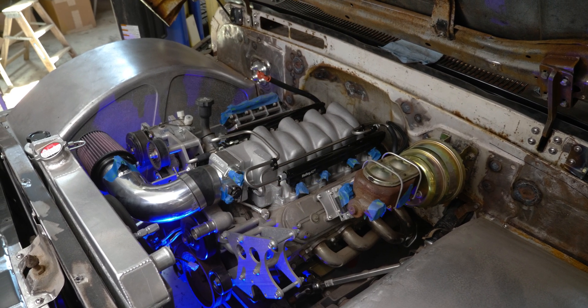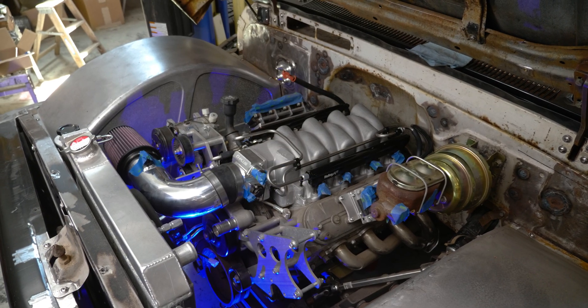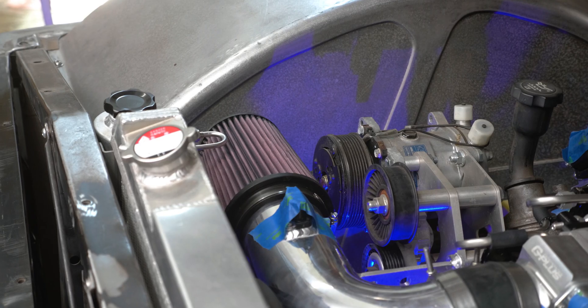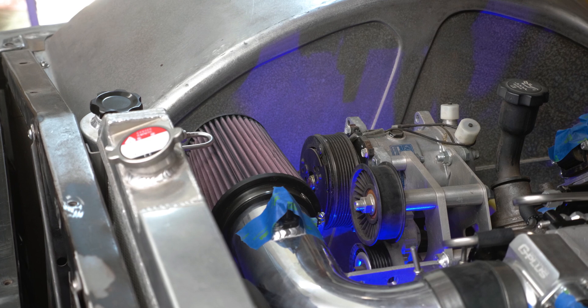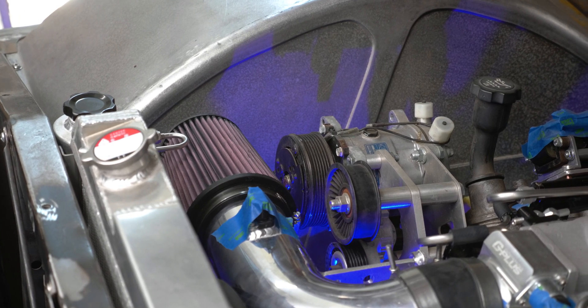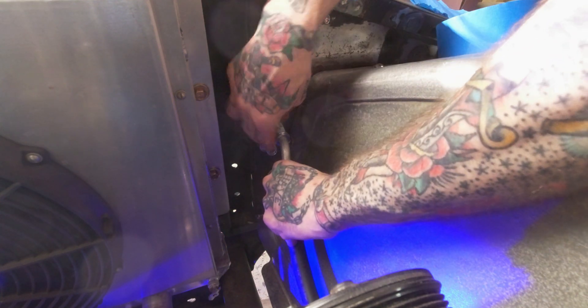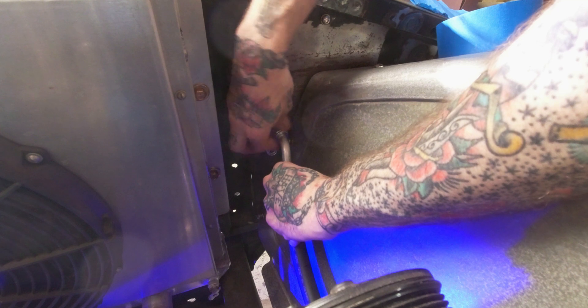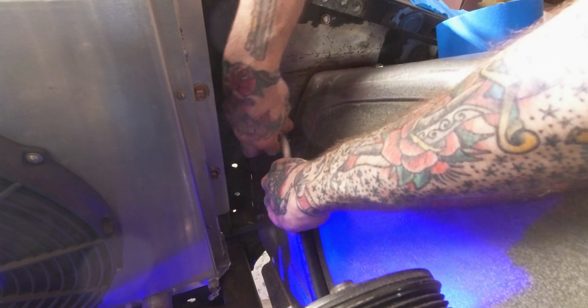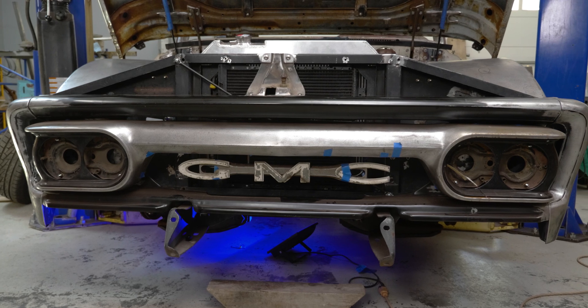When you're talking about rubber or polyurethane motor mounts, as your engine rocks, there needs to be some give in there. Your engine may get farther from and closer to your inner fender wells as it's moving, so there needs to be some line to move with that. And lastly is serviceability. A flexible line is just easier to work with and service. If you need to remove the AC compressor for replacement, or you need to work on the engine and get those accessories out of the way, disconnecting a rubber hose and manipulating it out of the way is simpler than a hard line can be.